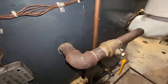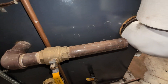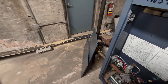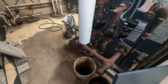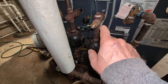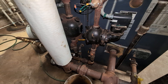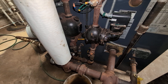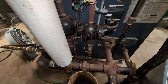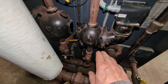Then I've got their skim tapping here — it's not too bad; I'm not sure why they made this so long. I guess maybe they only had a 12-inch nipple so that's what they used. Another disadvantage of the LGB is that they're built to use float controls, which I believe are a weakness. I generally like electronic controls — they're low maintenance. You have to blow these down at least once a week, sometimes several times a week, sometimes once a day, depending on usage. This is the secondary or emergency low water cut-off.